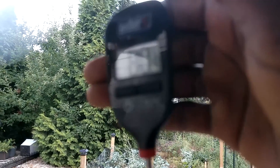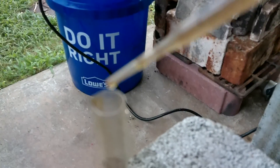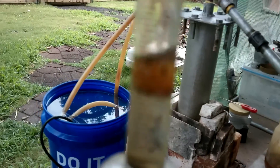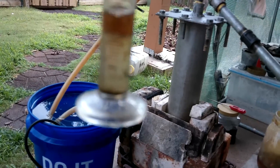The temperature at this point was really going up and down, fluctuating a lot - 80°C, 81°C - it wasn't really staying stable, so I don't really know what's up with all that. I wanted to do a little sample run with this oil to make sure it wasn't like ethanol - I wanted to confirm it was actual oil. So I poured it in a little beaker with some water, which is the best test because gasoline or oil won't mix with water. No matter how much I shook it up, it would not mix with the water. The color and viscosity look good - this may be close to gasoline. I lit it and the flashpoint's good.